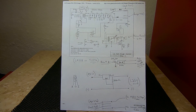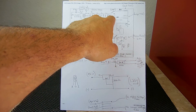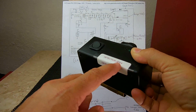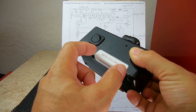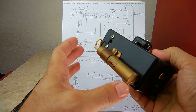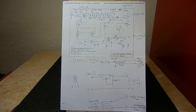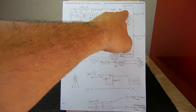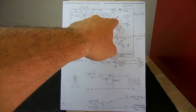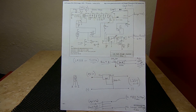Because my circuit has two different tubes, the upper tube inside the unit is a much smaller Geiger tube designed for higher levels of radiation, and the one on the side is a much larger diameter tube designed for lower levels of radiation and higher sensitivity. The smaller tube uses a three megaohm anode resistor, while the larger tube has a one megaohm resistor. To learn which anode resistor to use, refer to the data sheet for the Geiger-Müller tube you're using.